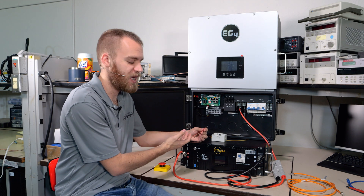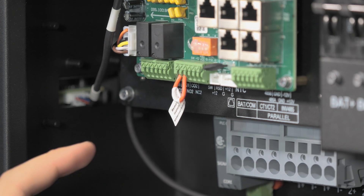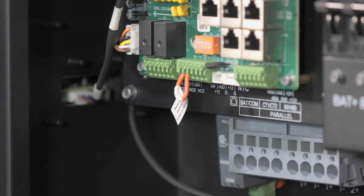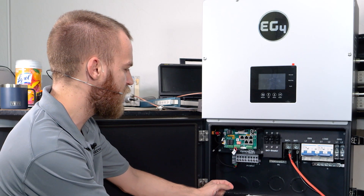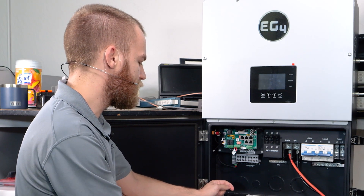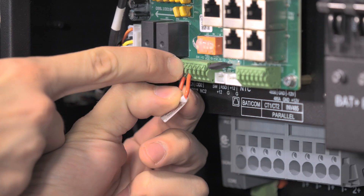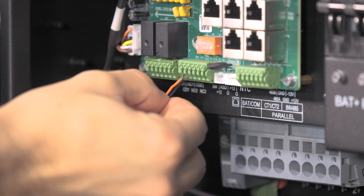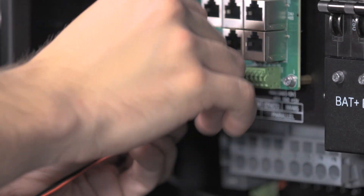For demonstration purposes today I have a couple of small wires just running from the switch, but the key thing to note is this little red jumper on the circuit board inside of the inverter. This is our normal loop — right now the inverter will always operate — however we can remove this jumper by depressing the little buttons above and sliding the wire right out, and now instead of this jumper we can use our switch to complete the loop.